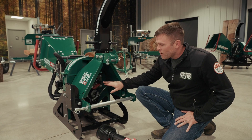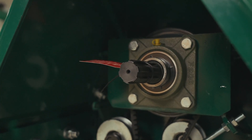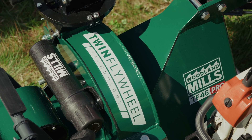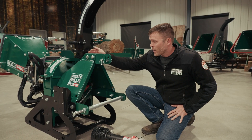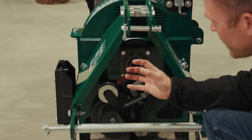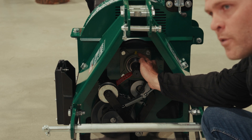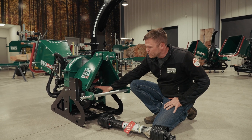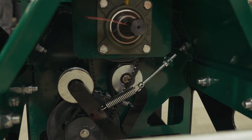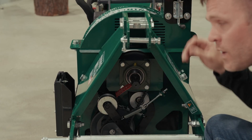As we look deeper underneath the guard, you're going to see the main drive shaft of the chipper. This drive shaft is being spun at 540 RPMs — your tractor's output speed — and it carries that through to the primary flywheel with the blades as part of the two-flywheel system. This shaft at an inch and a half in diameter is carried by a large cast-iron flange bearing with a zerk fitting at the top for maintenance. Below, you'll see the two drive belts that bring that 540 RPM down to the hydraulic pump to feed the infeed system and also gear up that speed to drive our secondary flywheel of the twin flywheel system.